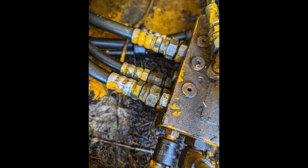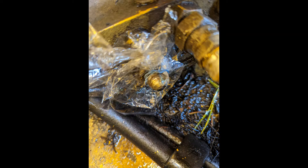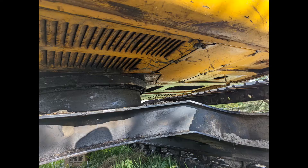I ended up taking the hose to a hose shop — there are a lot of them around. If you just look up hydraulic hose replacement or repair, you'll find them. You'll see here that I covered the hose outlet in plastic with a rubber band to keep dirt, grime, and water out of it. It can obviously cause further damage to your hydraulic system — more hoses to fail or your pump to fail. I learned that also on YouTube watching other videos.